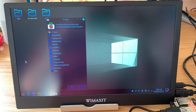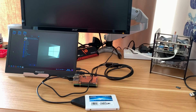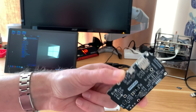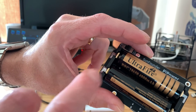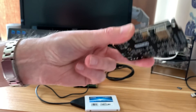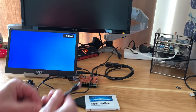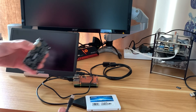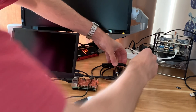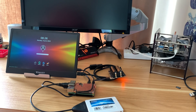This is an uninterruptible power supply from SunFounder — you can use it to power your Pi, and if you have a power cut it will keep things going. It's got USB-C to charge it and USB-A to power other devices, with a couple of lithium-ion batteries inside. Let's plug it in: we shut down the Pi, unplug from the mains, then plug through the USB-A connection and switch it on. It can power both the Pi and the screen — that could work as a tablet option.